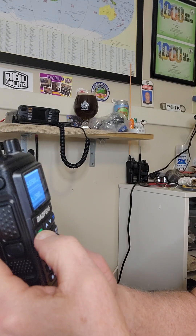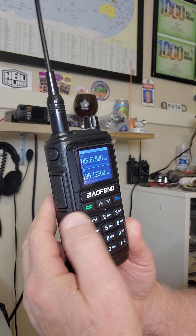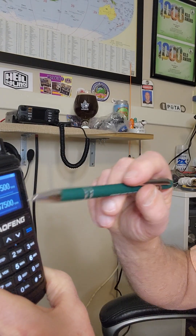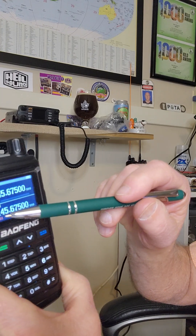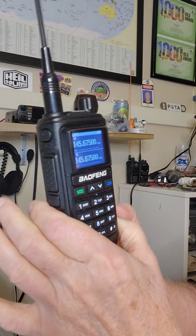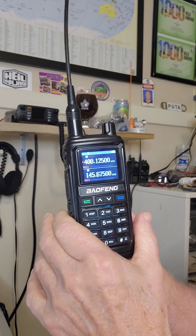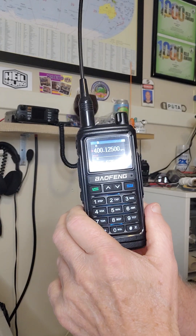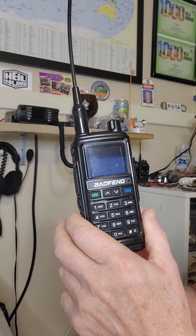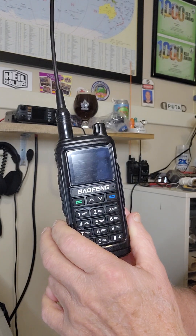After the reset I want to be in VFO mode. I'll press and hold the green button to get into frequency mode — VFO. I'm going to push in 146520, which is the two-meter calling frequency, and we're going to program it to channel one. VHF/UHF radios seem a bit weird about channel one, so I'm just going to put 146520 there as a placeholder.